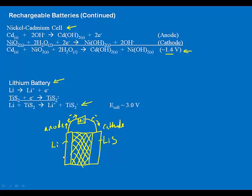That means that this electrode, lithium, would be oxidized, and what you would have is lithium ions which would move or flow through this polymer electrolyte. So the battery actually works when you discharge with lithium ions flowing in this direction through this polymer grid, and when you recharge it, electrons are pushed back and the lithium flows back and redeposits on what was the anode and now would be the cathode in the charging direction. So again, the new technology is great. You end up with a contained system that keeps everything intact in a way that it can be discharged and recharged many times, which fits our modern lifestyle and use of electronics.